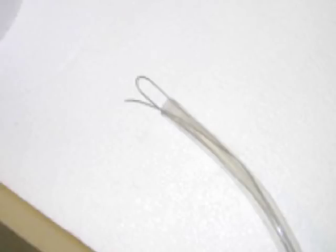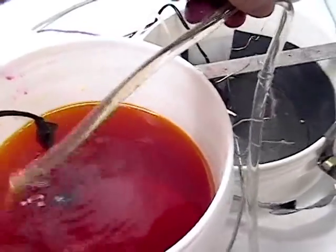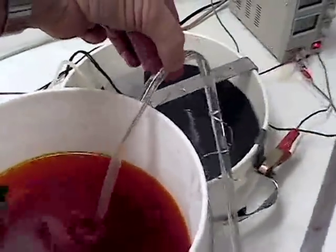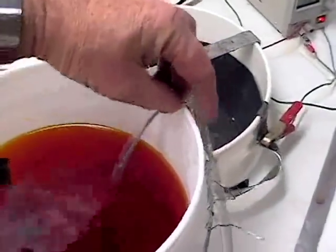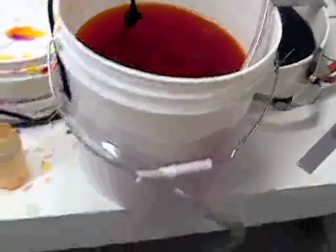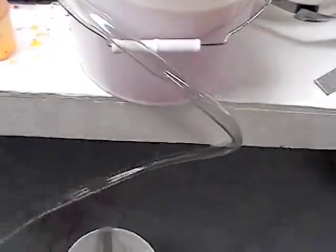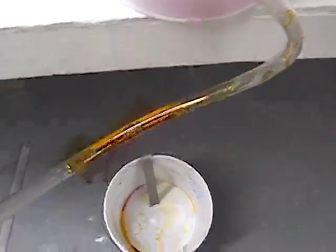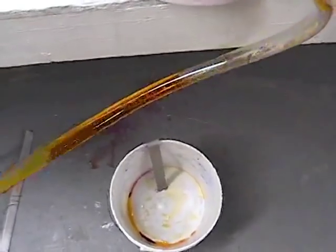Set a piece of aluminum wire into the tube to stiffen it. This will ensure the end of the tube reaches the bottom of the higher tank. You should also wire the tube to the tank to ensure it does not fall out and interrupt the flow. A loop in the tube is a good idea, as this allows you to watch a liquid enter without getting a mouthful. A few dollars invested in a simple fuel tank siphon may save you having dyed teeth.